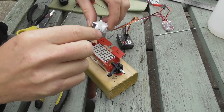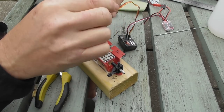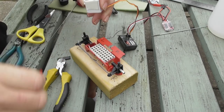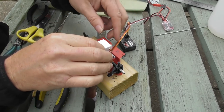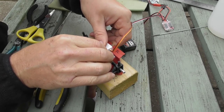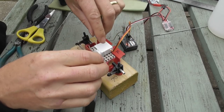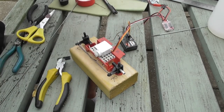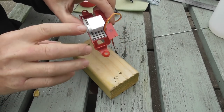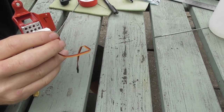I think I had it going this way around — push that in there. The servo arm has already been centered using the sub trim on the radio, and for now I'm just using one of my car radios, a DX4S. I may later go over to the Air 1 depending on how many channels I want. That sits quite nicely. And if I just turn it on and turn the wheel, that gives us quite a good sweep of steering. Both surfaces cleaned first with isopropanol alcohol — just check to see where it's going to go. That's firmly stuck down and it's certainly not going anywhere.